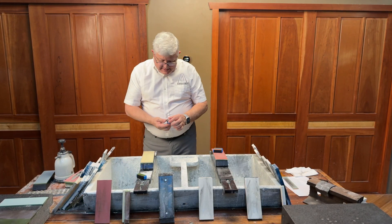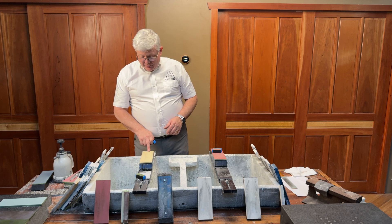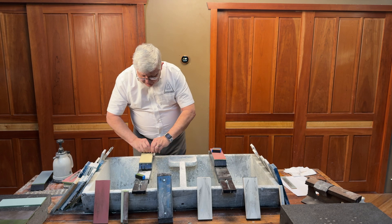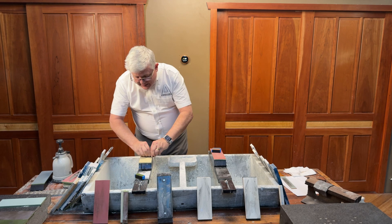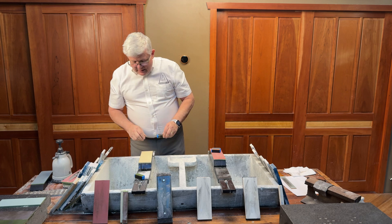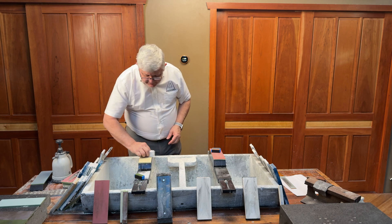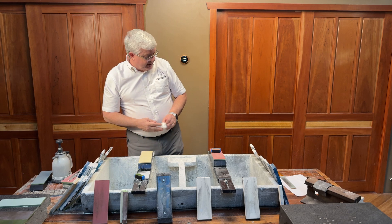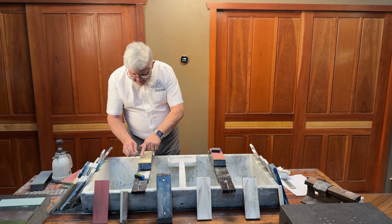Now I'm going to come back and take a 10 micron groomer — this is about two micron sizes bigger, and we have a 3 micron in between. I'm just going to finish with the 10 here. So this one micron diamond resin plate is all cleaned and groomed. Look at that — it just cleaned the surface right up very nicely. You can see the metal coming up on the paper towel there, and we're definitely ready to take a knife and go back to the diamond resin plate.